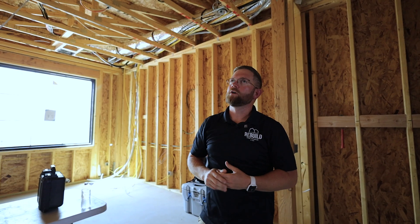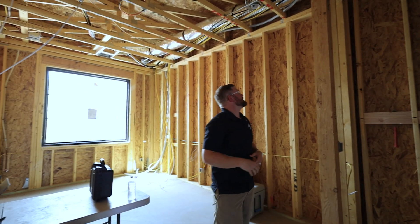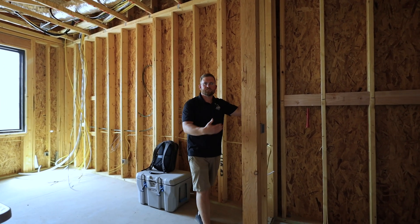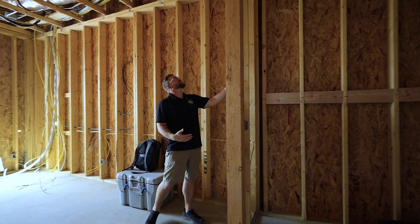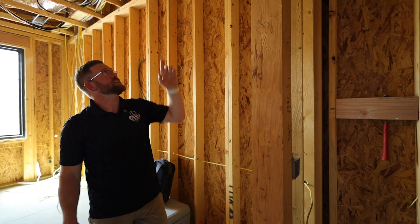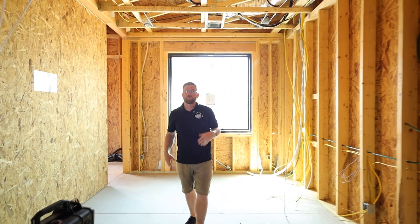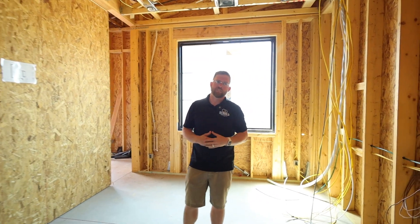Due to the height discrepancy between our 10-foot top plate and our 12-foot top plate in the family room, it requires additional structural components — including a three-ply girder truss hanging off a glulam — for structural rigidity and to split our HVAC system between the two spaces appropriately. We accomplished this by adding a small wing wall to divide the kitchen from the dining room, transferring this load through a 6x6 post on that wing wall, and allowing us to get our final 10-inch run of ductwork into the dining room to create a pleasant entertaining space.